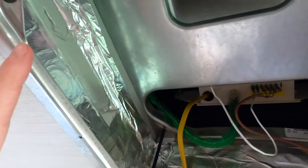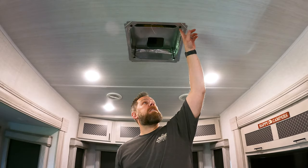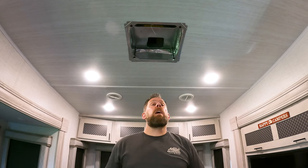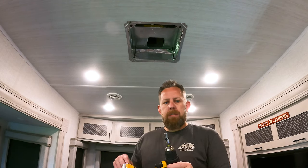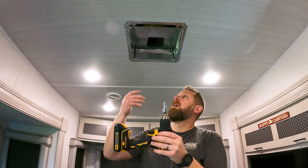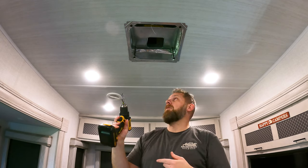There was a large void here so it was inefficient. The next step is removing the leg bolts. These leg bolts are what actually hold your AC unit to the roof, so they're in there pretty well. The RV Airflow system doesn't tell you which socket size — for us it's going to be a 5/16. You can choose to do this by hand, but I'm going to use the drill.